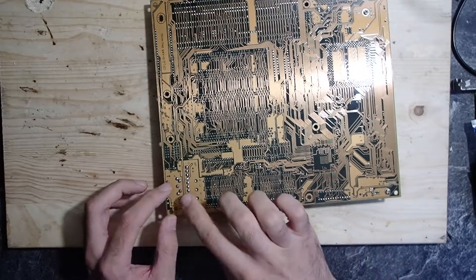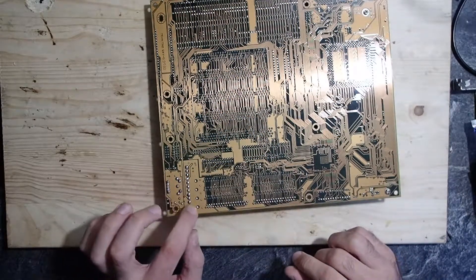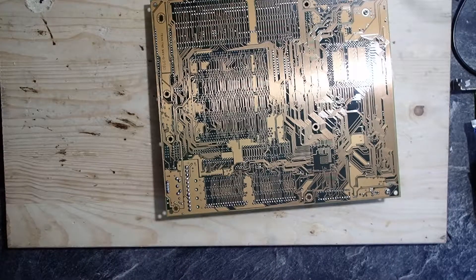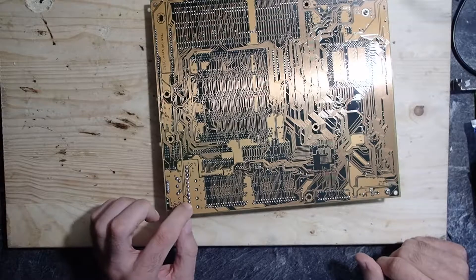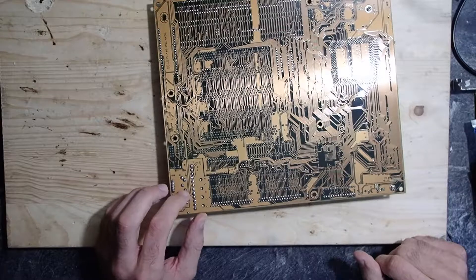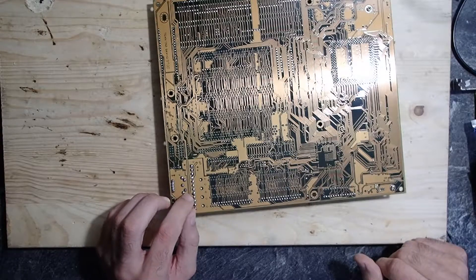I decided to add a 100 ohm resistor between the 5 volt power supply and the keyboard pin. This would actually bridge the 600 kilo-ohm resistor on the front side, so I will not worry about that. After this modification I hope we will get enough power for our keyboard.